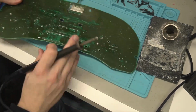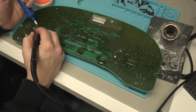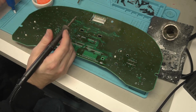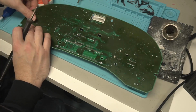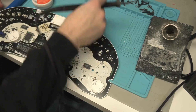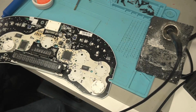And then we will use a hand desoldering pump because this thing doesn't have a desoldering gun to come with it. So why would I show using a desoldering gun? So, yep, functions just fine for any of your daily use kind of tasks that you would do with an instrument cluster. So we can desolder our stepper motors just fine. We can reflow the chips, and I mean, what else is there really to see? We can put the big guy on there and show how much thermal capacity these things have. This thing really could take that guy off pretty easily. But yeah, I'm not going to bore you guys to death all day with this thing.